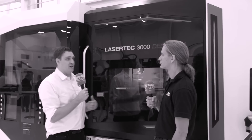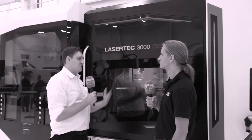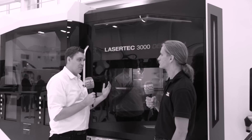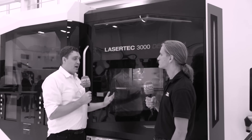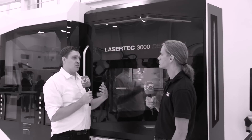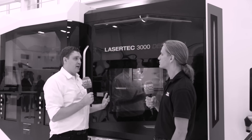Since we have all the machining capabilities, we can 5-axis mill, we can turn, we can pinch turn, we can do all sorts of operations to generate those shapes. One of the potential benefits is reducing how much time you spend in cut or how many chips you create on a part.